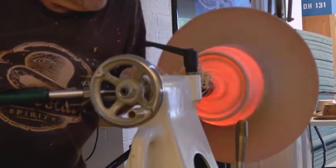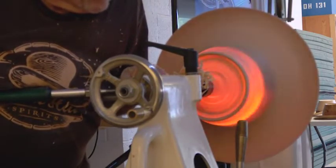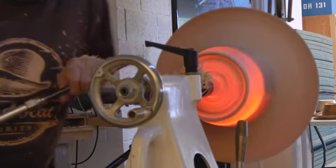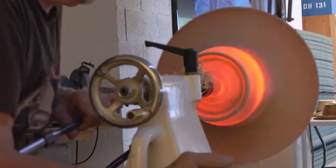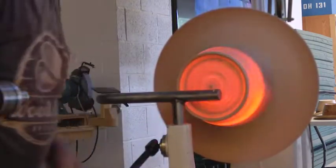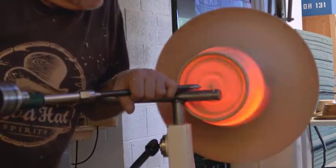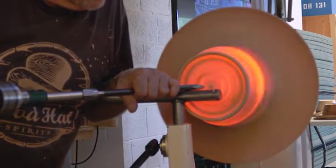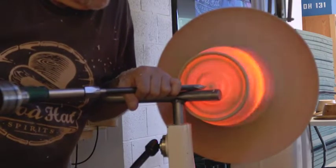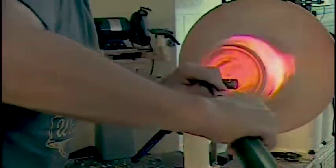So I get this out of here. It'll stay on the chuck well enough for the little cuts that I have left to do. Now I can do a bevel rubbing cut and get rid of all those ripples. In the middle, I can push the cut this way. But the rest of it, I got to come from over there. Like this.